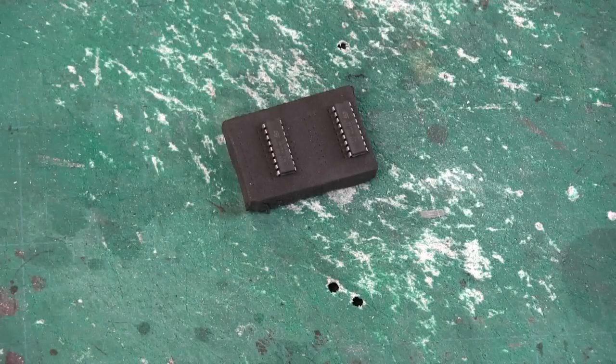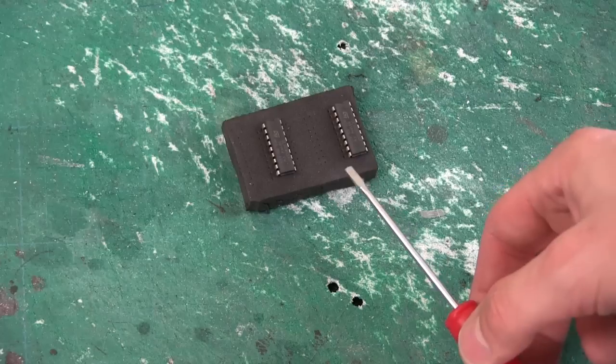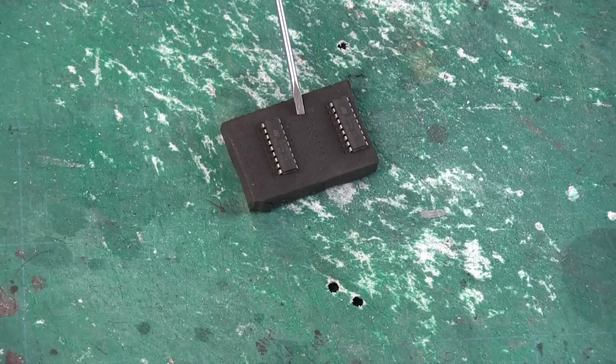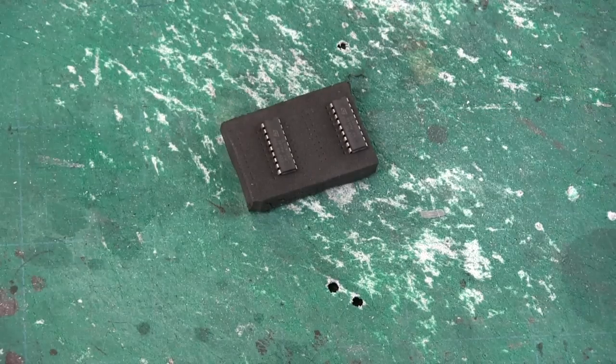Saying I was going to use relays, in fact I'm not. I'm going to use ULN2803 Darlington arrays, which are these chips here. I'm only going to use one of them. These are basically an electronic switch — you give them 12 volts and ground on the bottom two pins, then simply take in a logic level, a low power signal on the left from the Arduino, and you get a half amp switched version on the right. You can bond all the channels together — there are eight channels in here, each capable of half an amp, so if I bond them all together I'll get four amps capability of switching, which is more than enough, since the 5 volt regulator I'm using to power those servos is only capable of two amps. So I'm going to build this in a little circuit and then we can power those servos down when in the home position.